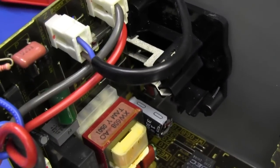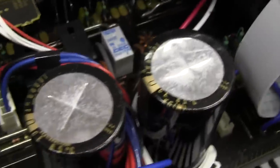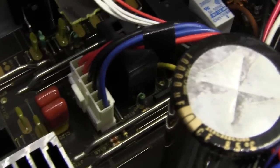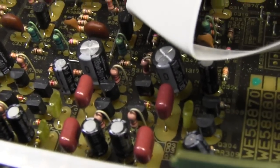Now let's have a look at that mains board in more detail. There are relays on there, a nice looking heatsink, and that is the main power board. Don't you just love those huge bus bar links in there - massive links on this single-sided board. I love the design of these single-sided boards inside higher-end consumer grade gear. All the caps appear to be Nichicon brand, even the small ones. They haven't skimped at all.